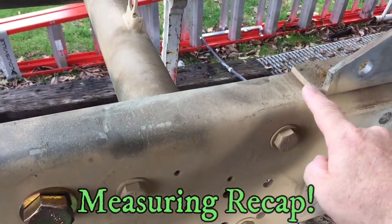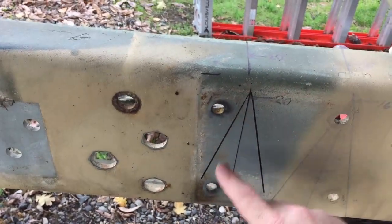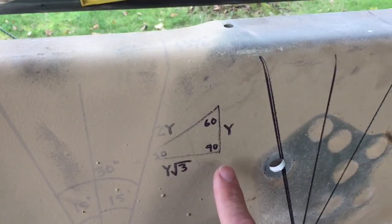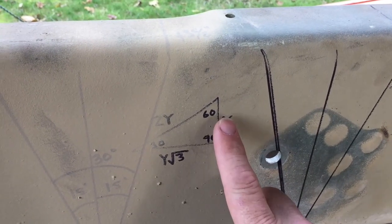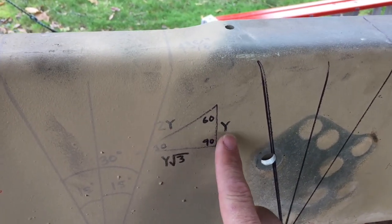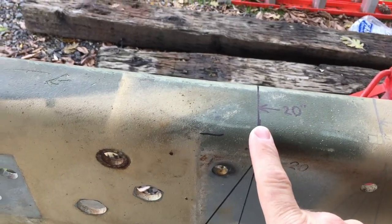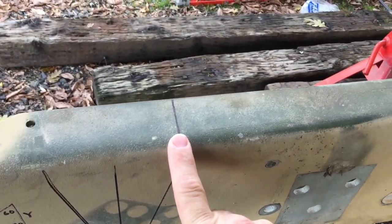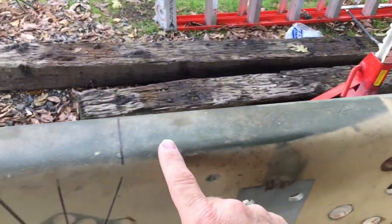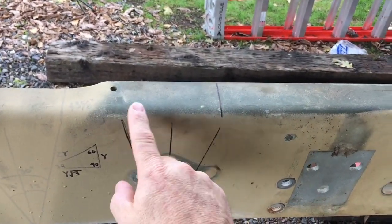So this is a recap: from this point to here is 20 inches. I made it easy on myself — this is a 30-degree cut, which is going to tilt this at 30 degrees. Using a 30-60-90 triangle, I know that the drop I need is eight and a quarter inches. All it is is two times eight and a quarter, which makes 16 and a half. So from this 20-inch point, I need to go 16 and a half inches — making this 36 and a half inches from that corner. That is where the actual back bend is going to be, and this part is going to be welded to here.